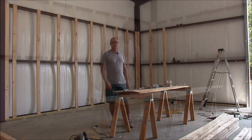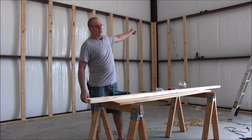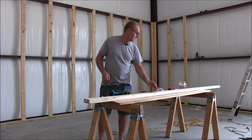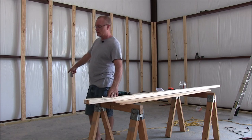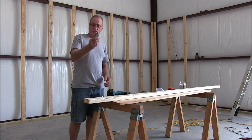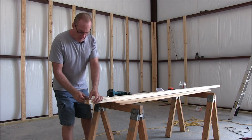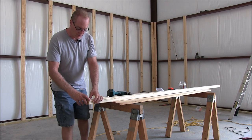I'm going to finish up the rest of the studs here. The studs are nine feet tall to that top beam — these are 10-foot 2x4s, so I cut a foot off the end. To connect the board to the bottom 2x4, I already drilled into the concrete and put in concrete screws, so that's all set. Since I can't nail these, I'm using a Simpson Strong Tie angle plate that'll screw right onto the bottom of the 2x4 and into the base.